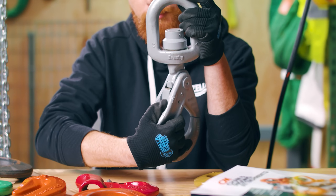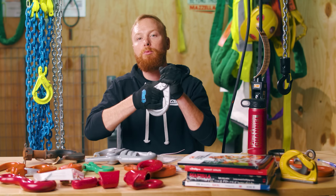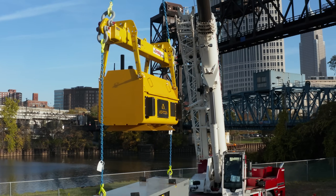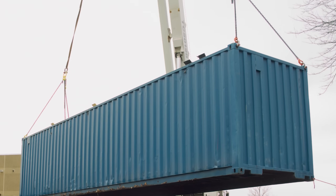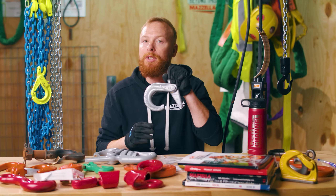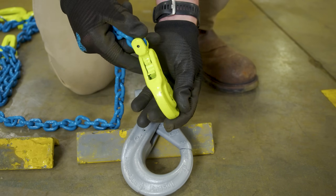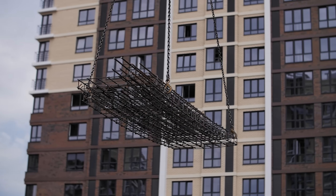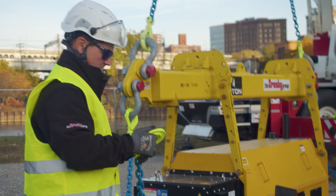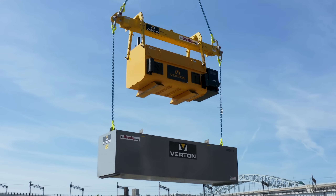This is a self-locking hook. They are also known as positive latching hooks, self-latching hooks, and often colloquially known as safety hooks. They have a throat opening that will close and lock when a load is applied, and will not open until the lock is manually released. The advantages of self-locking hooks are first and foremost safety — a load will not slip off the hook. The latch cannot be opened until the weight of the load is off the hook and manually released, preventing premature release of the load. The second big advantage is durability: with a forged latch built into the hook itself, you do not have to worry about the latch being easily damaged or the spring wearing out. The disadvantage is that it may take a bit more time to attach and disconnect your load due to the manual release required, and the price is going to be higher along with the weight.